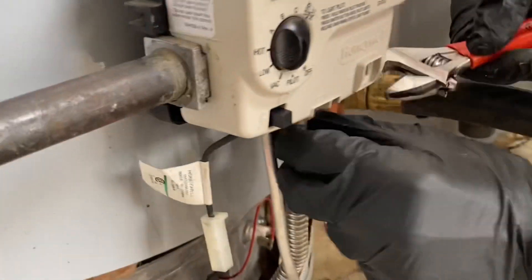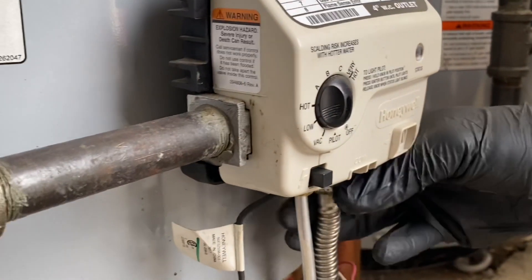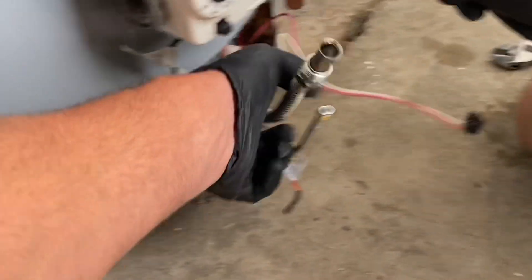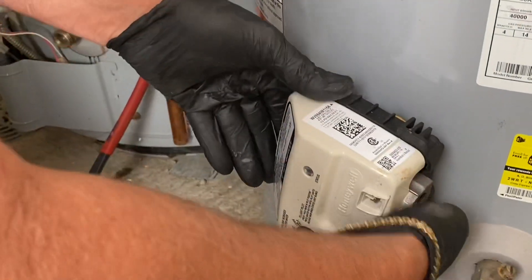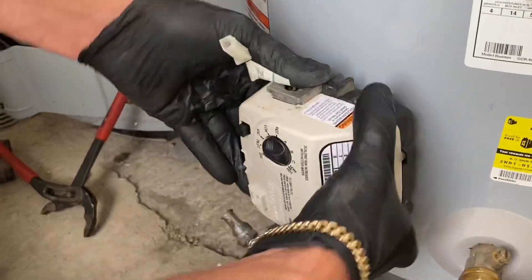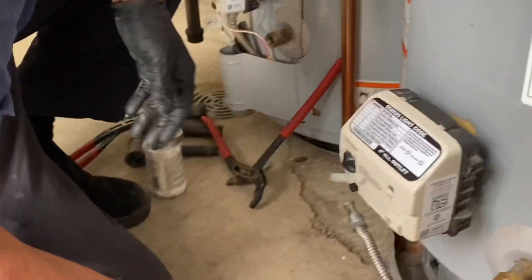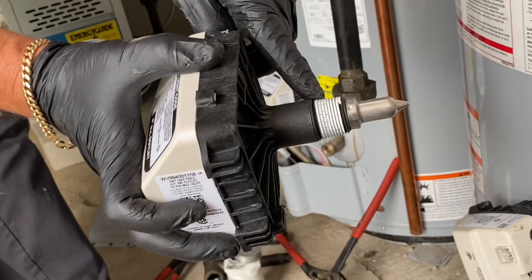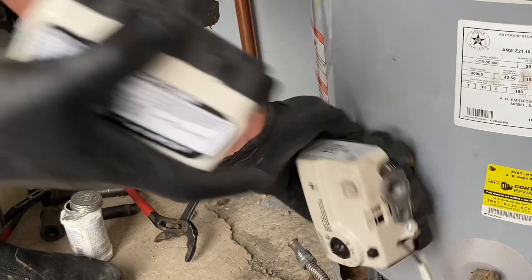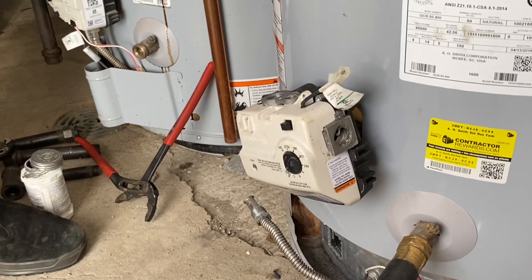Daniel's going to disconnect the main burner tube from the bottom of the gas valve and then disconnect the pilot tube. Everything's disconnected — just going to push this off to the side carefully, take a large channel lock, and get in there and undo this. Now I've got the new one handy. This already comes with some pipe sealant so we're not going to add anything there. We'll pop the release valve real quick to take the pressure out — a lot of water there, but here we go.